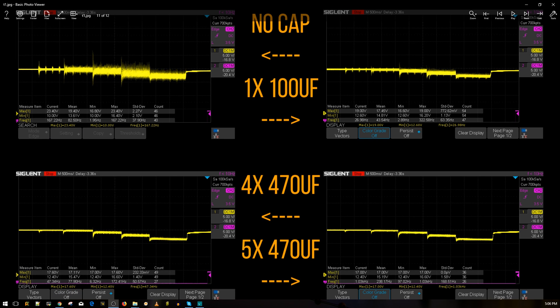Alright guys, the results are in. I've been looking at them for quite a bit now, and each and every single one has a difference, so it's pretty spectacular. The first configuration is the ESC without any capacitor or filtration on the quadcopter — that's the top right corner labeled 'no cap.' Then there's one 1000 microfarad low ESR capacitor connected to the main flight controller, which was the best result out of all previous tests.